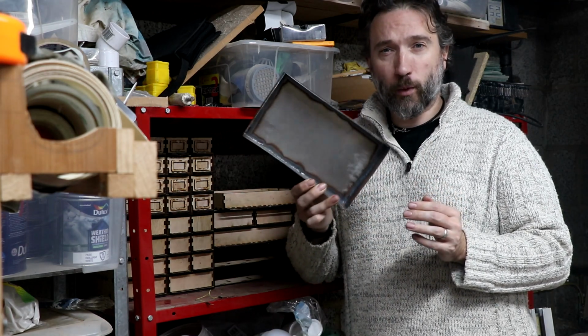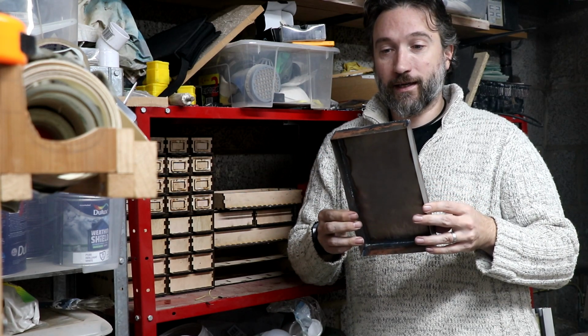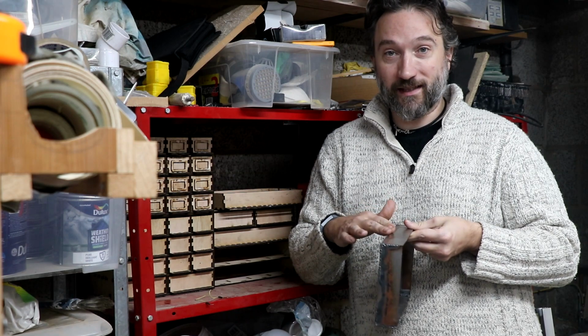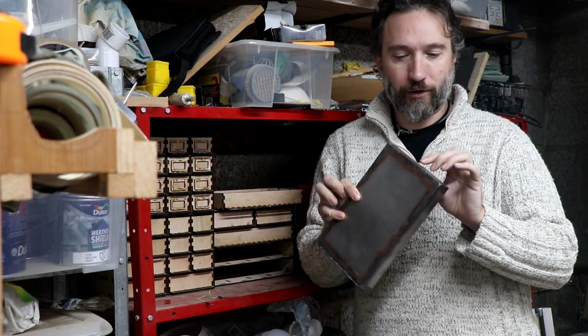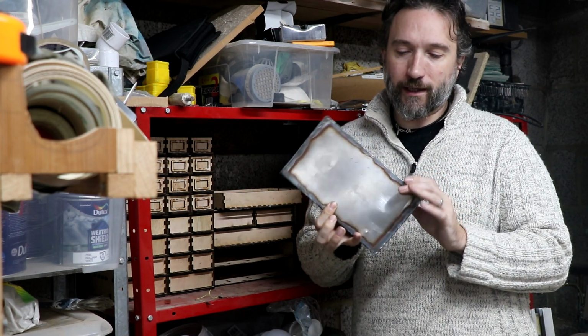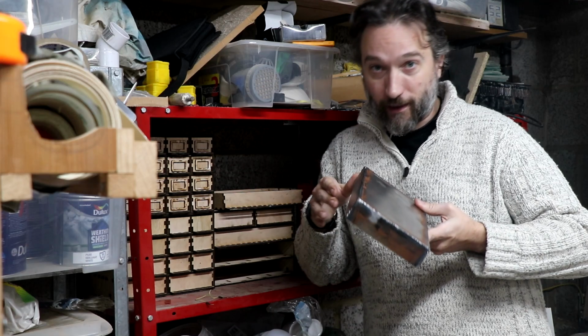This is 0.8 mil thick steel, so it is quite fiddly, and the key that I learned is you really need to back up the weld with like a chunk of aluminium, basically something to act as a heat sink to let you melt precisely where you want, but keep the heat down. The first couple of edges I was a little bit rough with, and I was trying to add filler rod, and it was going okay, but then I got into my stride with getting aluminium clamped in the right place, and I was able to just gently melt the edges together with no filler.